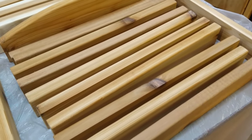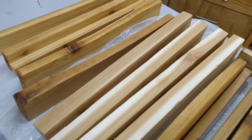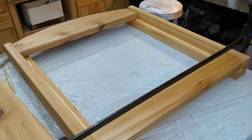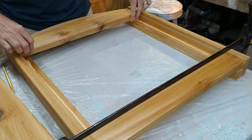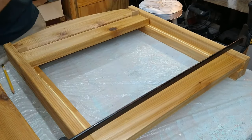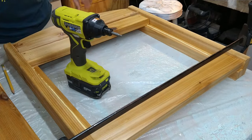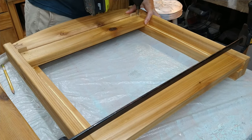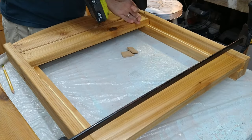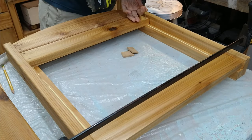Here are all the components: the slats in the front, a rounded piece that's the top of the back of the chair, the four two by fours for the legs, and the glued supports for the back and the bottom. In the next step the slats are connected to the supports for the back and for the seat — you can see I'm screwing them into the sides with a small headed deck screw. I'll put a link in the description for all the lumber and hardware. These deck screws give added support over wood glue and I'm really happy with the way they look — they don't stick out very much and it's a very clean look.